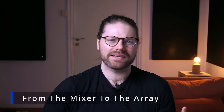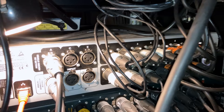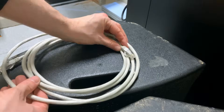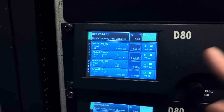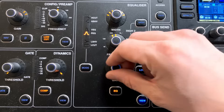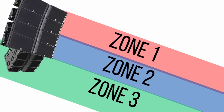How does sound get from the mixer to all these speakers? It goes from the mixer into a system processor — a matrix system — which takes your main left/right mix and distributes it to all the amplifiers you need for left, right, subs, front fills, etc. A CAT cable is run over the roof through any walkways to the location where all the amplifiers and the system processor are. The system processor deals out sections to the amps: one amplifier for the front speakers and down fills, another for the middle, and another for speakers pointed at the back of the venue. This allows you to alter the EQ curves and delays to make sure all the speakers play seamlessly and everything sounds the same across the whole venue.